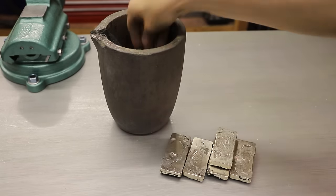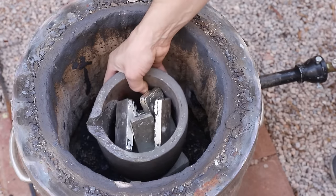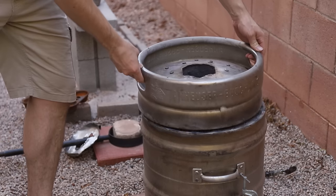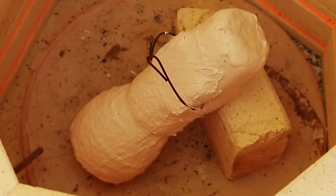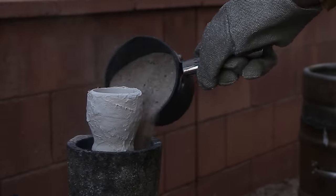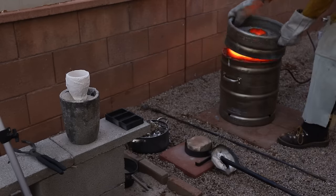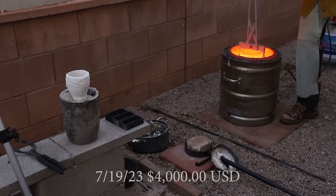While the kiln was heating up, I started melting this glorious pile of silver. Having carefully designed the hammer and sprue, I knew that their combined volume was 12 pounds exactly. Things happened fast when the silver was ready. I quickly removed the mold from the kiln and placed it into an old crucible, then poured hot sand around the edges to help keep the mold in place. Then I carefully lifted by far the most expensive crucible of molten metal I have ever lifted out of the furnace and poured it into the mold as quickly as possible.